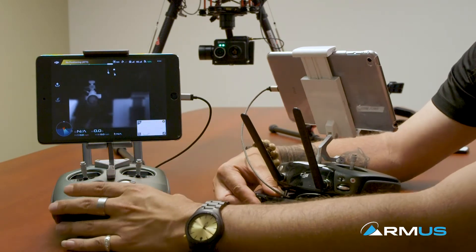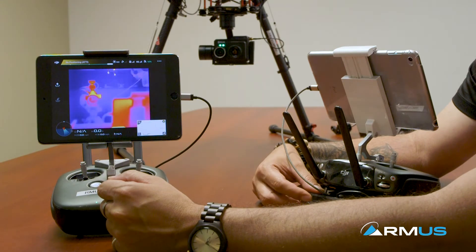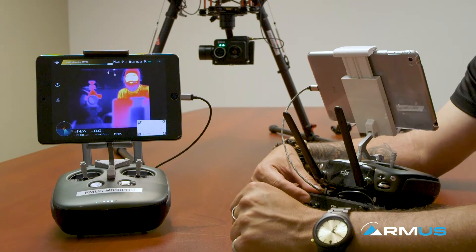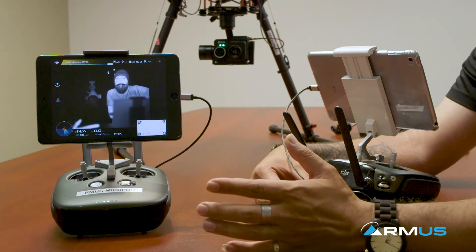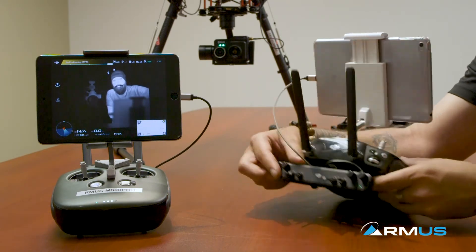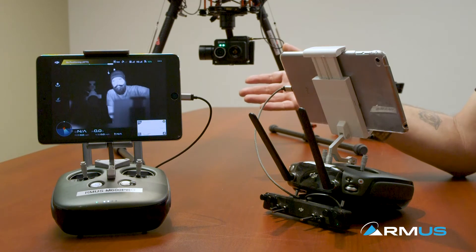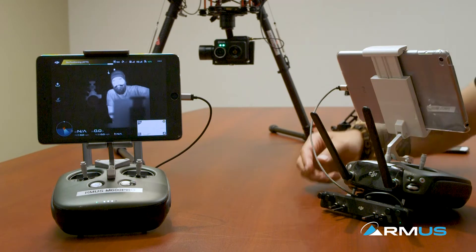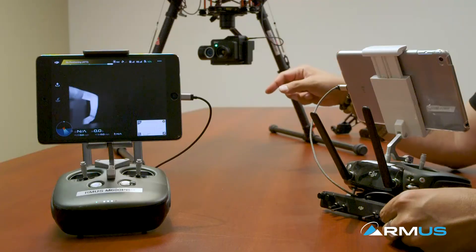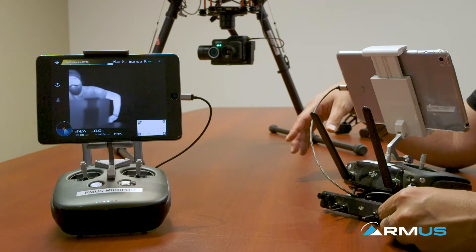When we have something really hot in the scene, like Jace, we can ask Jace to move out of the scene and see what actually changes in the shot. We can see that it has highlighted a little. This is just the way the thermal camera operates. If we change a couple of color palettes and put Jace back in the scene, we can see how the camera displays these color palettes depending on which one you set. We can only configure the PWM to do three color palettes, so we have it on a three-position switch. The DUO also has a GPS input on the side, included with the camera, running up to the top — we can see the GPS tagging that has been done. Let's go take it outside and see how it operates in flight.